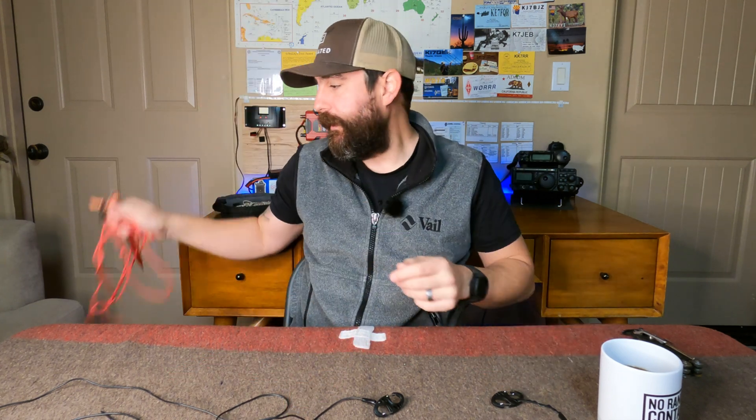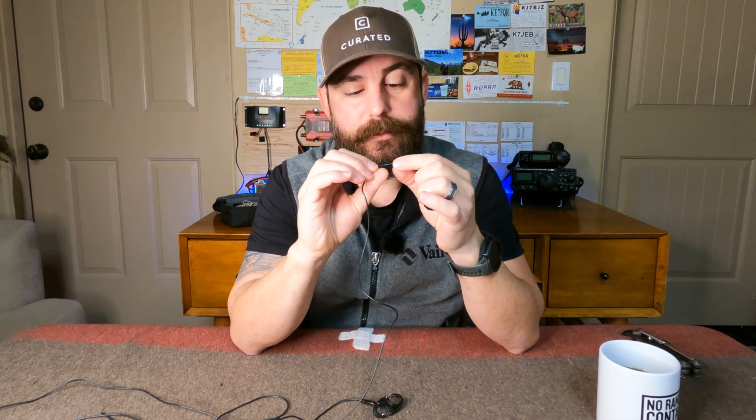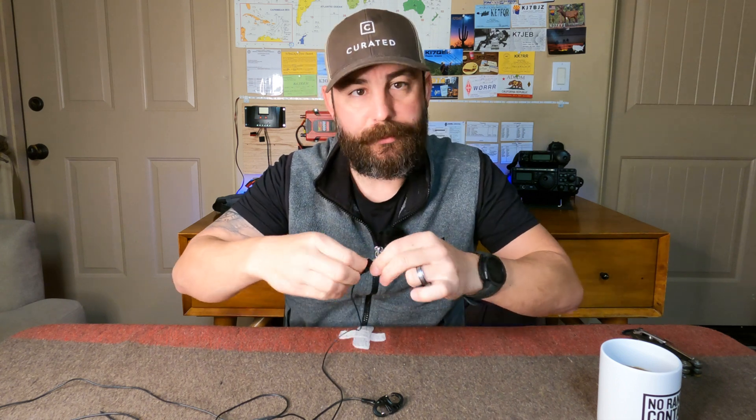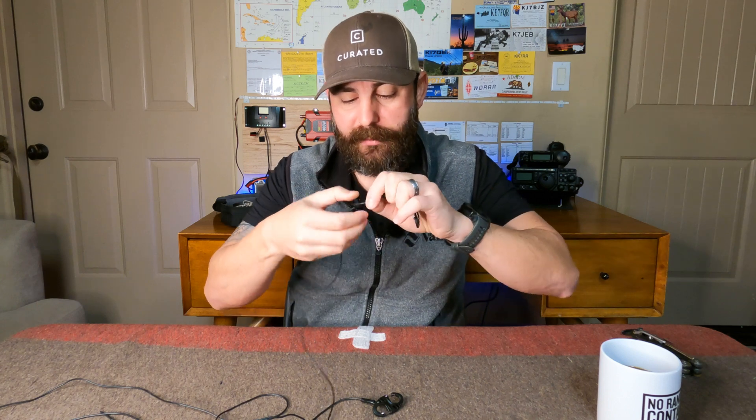I lowered the top section and took our element. The design purpose is to be able to remove the electrical tape at the end - you can remove it multiple times. If it gets terrible, you can just replace it when you get back to the house. I had a little bit extra, so for the longer lengths I maxed it out - undid the S-clip carabiner section, pulled it in until there was maybe an inch on the end, and wrapped electrical tape around it. That was the max length I could go. I put tension back on everything and measured - the resonant frequency dropped down to about 58 megahertz, which is better, but my heart sank because that four inches I cut off at the shack was significant.